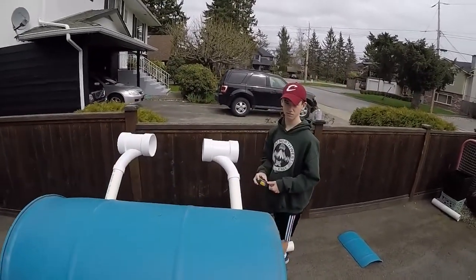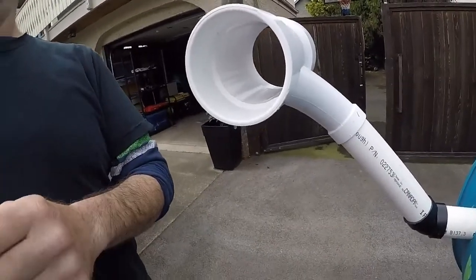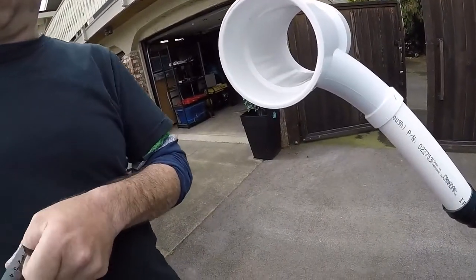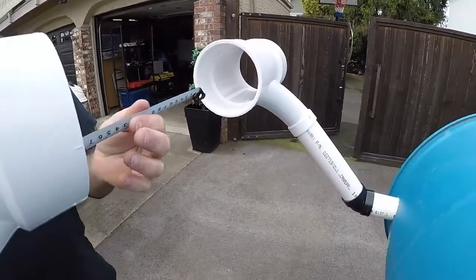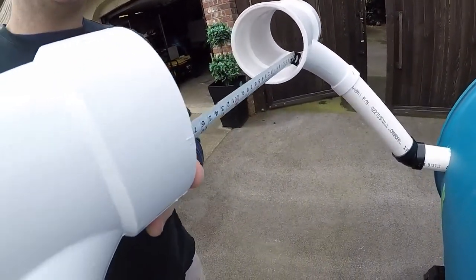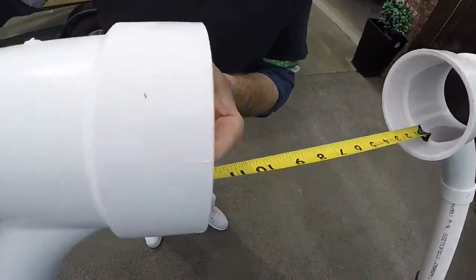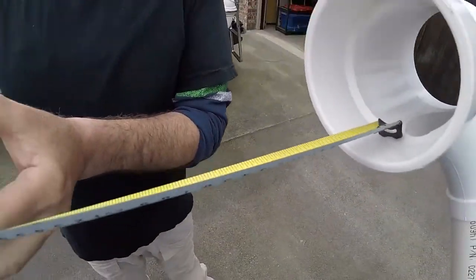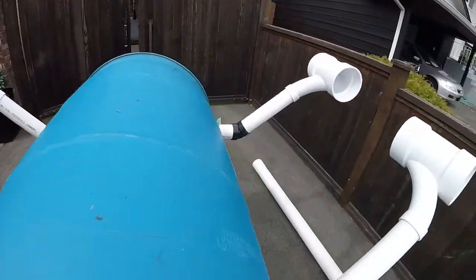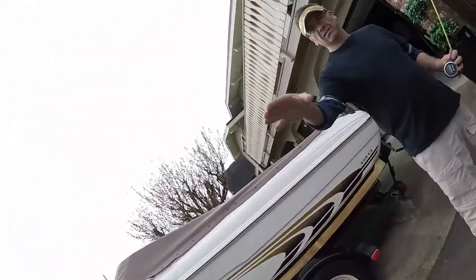If you hold this, I'll show you where I'm going to measure. It's about two inches deep — quite deep. So what you want to do is go from in here to about there. I can now see that it's about 14 inches. So if we cut our pieces at 13 and three-quarters, we should have enough on each side.